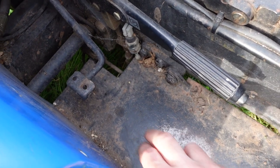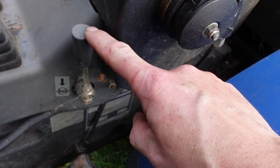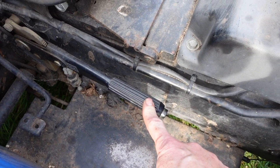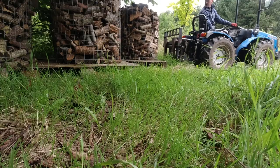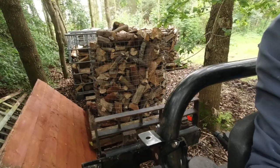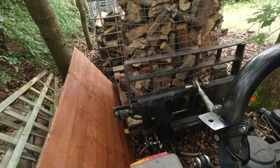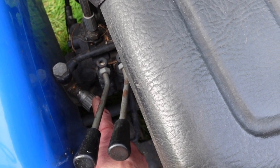Just in case you get stuck, there's a foot operated rear diff lock and a hand operated front diff lock. Both disengage the minute you let them go — they're only engaged as long as you're holding the lever or pushing the pedal. There's the handbrake, and the spool valves: one raises and lowers the arms, and the double acting spool valve pumps both ways. This little control here is for the speed at which the arms raise and lower — screw it in for slower, spool it out for faster, depending on what implement you've got.